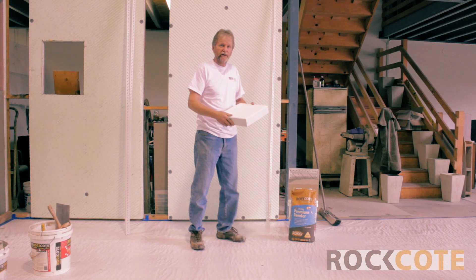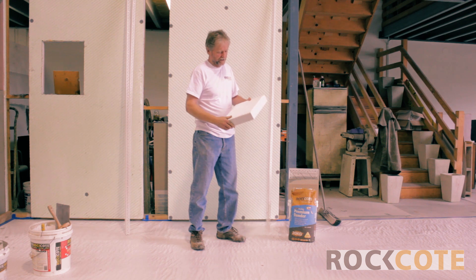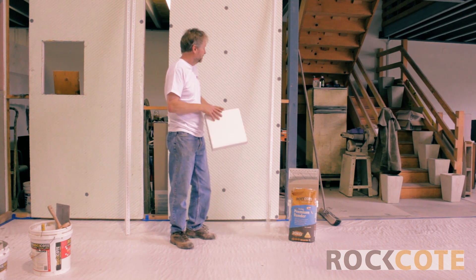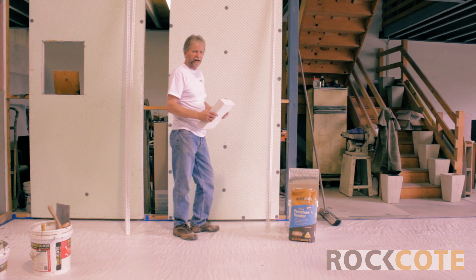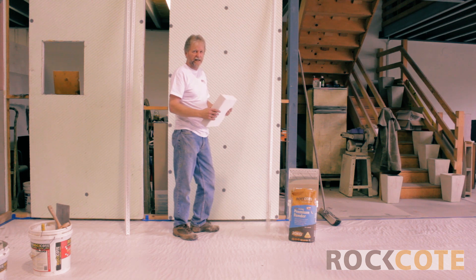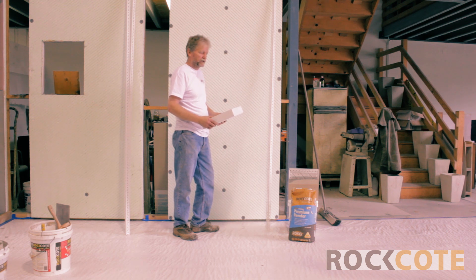Now we can also render polystyrene. This is a rather newer type of building material, but it's excellent for insulation and very easy to use. It comes in different forms — there's the plain white polystyrene, and here we're using the NRG green board, a proper building grade polystyrene. It's got a bug resistant material and a proper surface for render. You do get other ones available with a mesh already built into them, but that mesh doesn't really do much — it's back against the surface of the board, so you've still got to follow this same system for those mesh boards as with the building grade polystyrene.